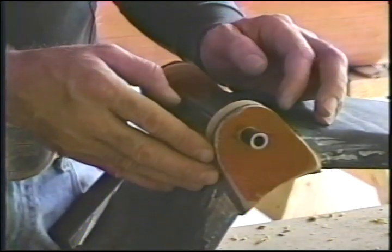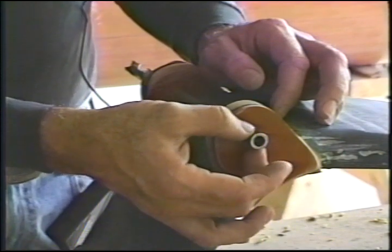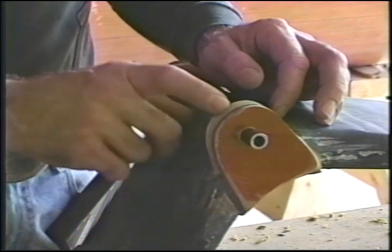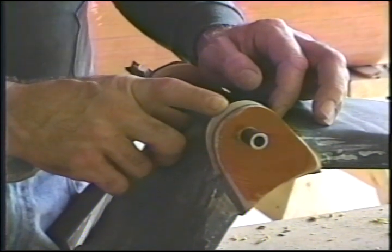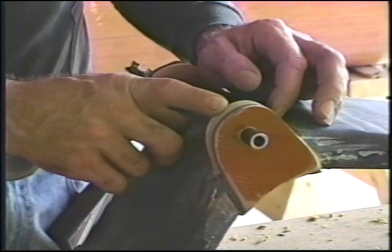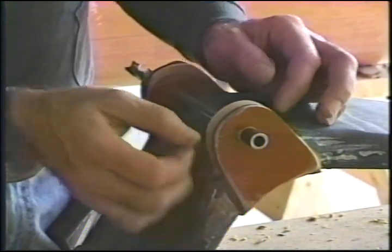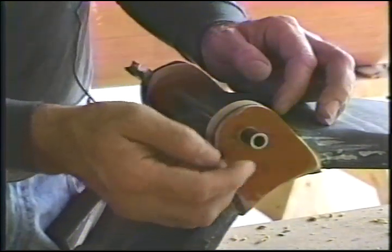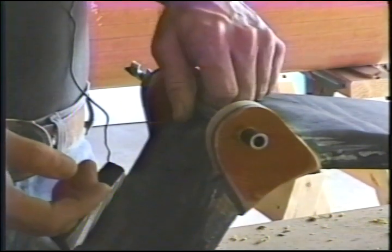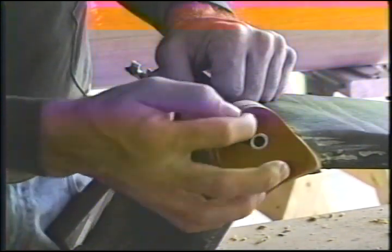Composites are hygroscopic. They will hold some moisture, which means I want to treat the outside of this bushing with something to prevent it from rusting between the composite material and the bushing itself. The Loctite potting compound that I referred to would be perfect for that. It bonds beautifully to steel, would prevent it from corroding on its exterior surfaces. You can put a light grease on the shaft bolt when you install it. These will be CAD plated in the future, but at present they are not. So that's how you handle a corrosion problem in an area that you can't get to.